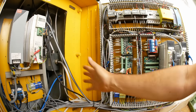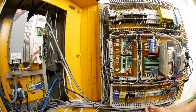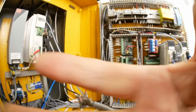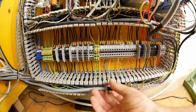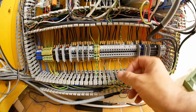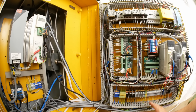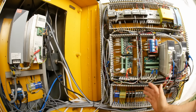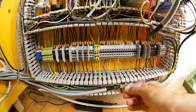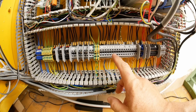Basically everything from here backwards is, at least for those two systems, original Schaublin. This is the control cable with all the hall sensors in it — a high-quality oil-flex cable. Here's an example: this is original Schaublin, I haven't even touched it. On the end of the shielding they've crimped a ferrule, put a pigtail lead onto it, and that lead goes off to earth and then to a single star ground with everything else. Given the quality of Schaublin's work, I'm going to assume my wiring is not as good as theirs. Let's trace through my wiring and see if there's a spot where those low-voltage signals are running in parallel with the variator three-phase signals.